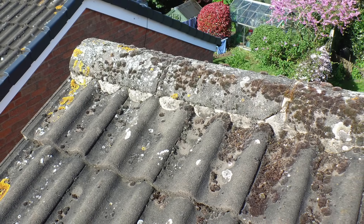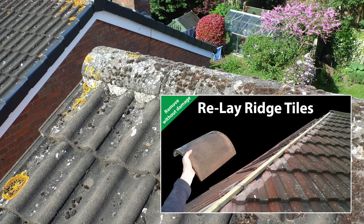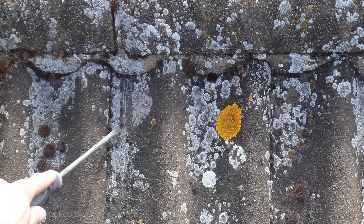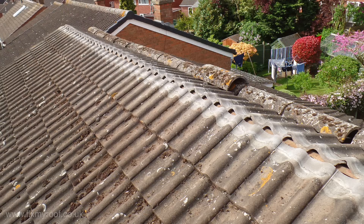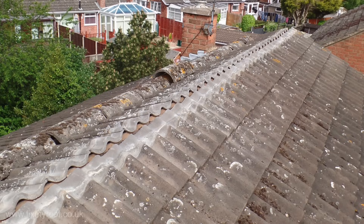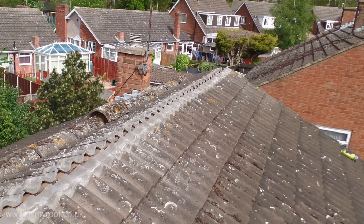Here we are on the roof and ready to remove the old mortar. I'm not going to show you how to do that because I've already covered it in another video, which I'll make available at the end and in the description bar below. But before removal I've taken time to mark the original position of the joints in the ridges onto the roof with a simple scratch line, so that when the ridge tiles are removed I have some general idea where they were originally positioned. This should stop me being short of ridge tiles if I compact the joints too much.